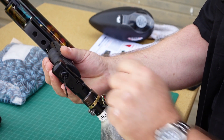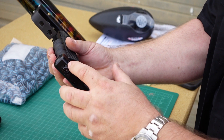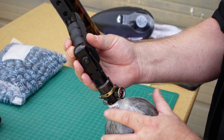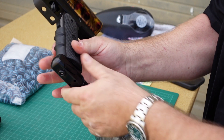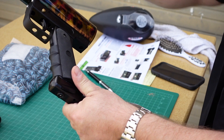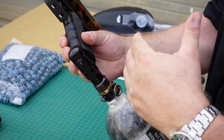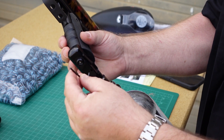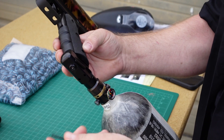This is what you're really going to use to do your velocity. The reason why we did this and have two adjustments on it is that this is a super high flow rig and it is very sensitive and it responds very quickly because it has to fill a low pressure firing chamber here. It's very sensitive, so we wanted to set a kind of a max pressure so that when you're adjusting with the smaller one, you don't go supersonic and burst the hose or anything in here.